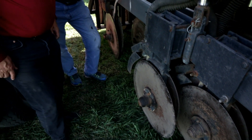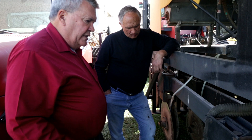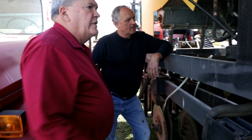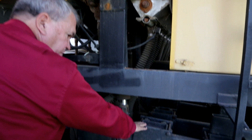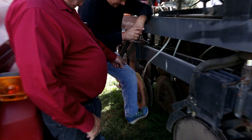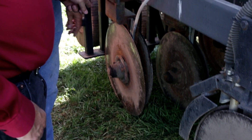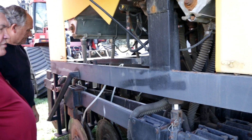The blade has to rotate to release the seed — you can see it come out when I rotated the blade. That means the seed gets released into the ground with absolute accuracy, just releases it without a bounce. That's a 24-inch seed blade, and they're in pretty good shape — probably 23 and a half inches now. Original paint job; I had the whole thing stripped down five years ago and redid it. There was nothing underneath it and we just did the job right. This is the dry metering screw for the dry fertilizer and for in-row starter.